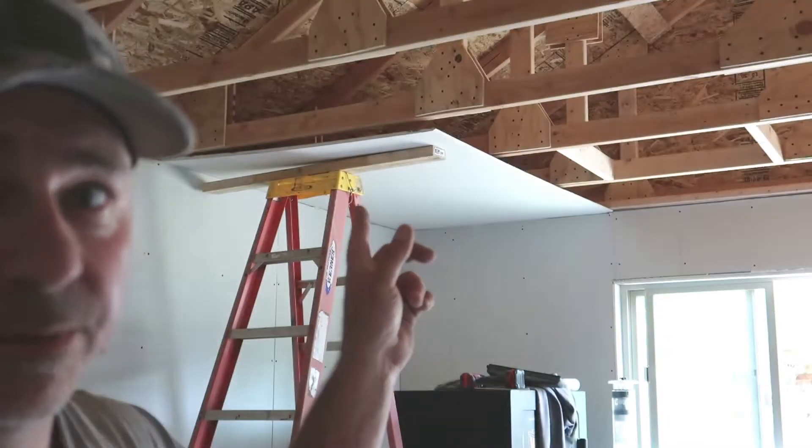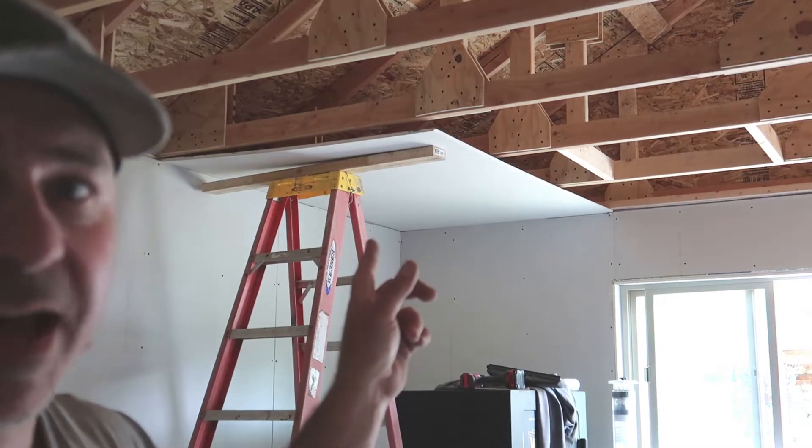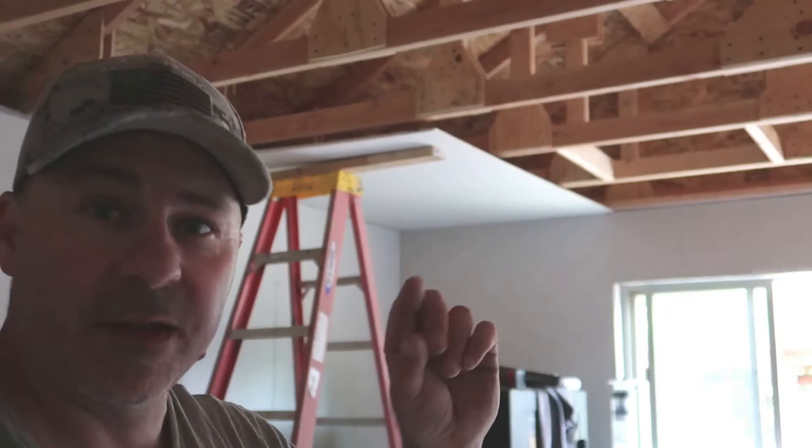Since I'm doing this by myself, I've taken my eight-foot ladder and put a two-by-four up on it to help steady it. Then around the perimeter I've left enough gap to set the drywall into it to help me hold it up. That was the idea and thought behind it — that way it kind of rests on there. The hard parts can be right more in the middle where there's nothing to use, but it'll help me out.